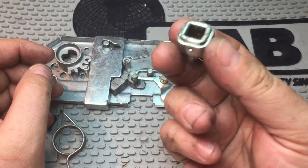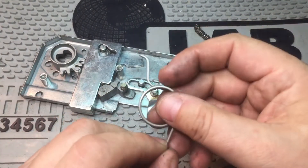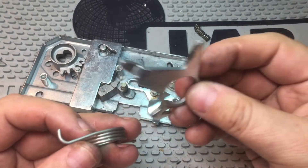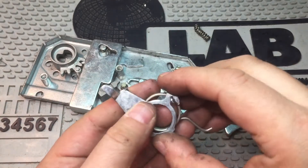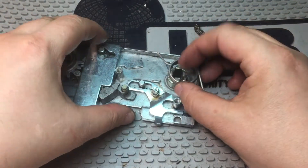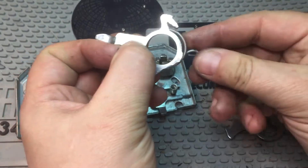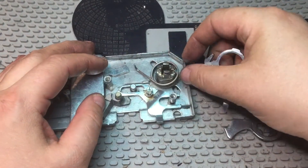Next we have this typical hub. The main spring that keeps the hub under tension is different from the other one — it's not as high as the other one. But this section here is compensating for that, taking up the exact same space so that everything else can remain the same. To get this under tension, it rests against the inside of the case and is forced around with a quite strong spring to hook onto the side. I'll just put this in as a spacer for now without being under tension — you just need to get the distance right.